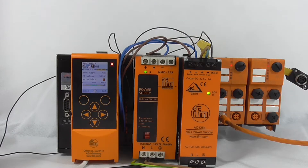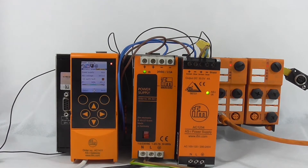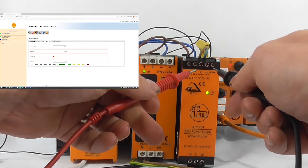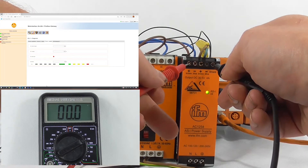Next, we will ground the ASI plus to ground. As can be seen, the voltage swing has swung to the negative side. The earth fault indicator has come on on the diagnostics plate for both instances.